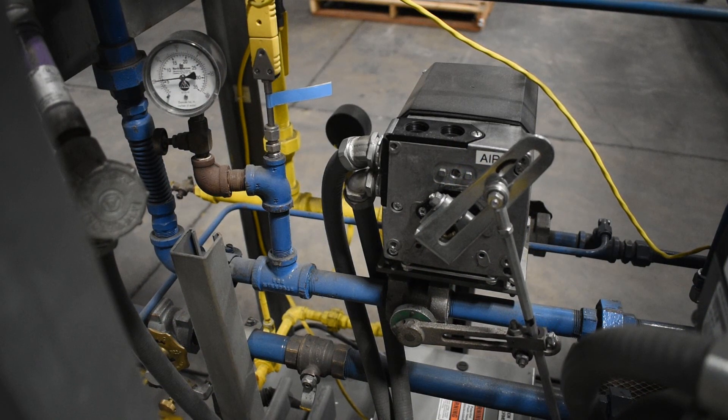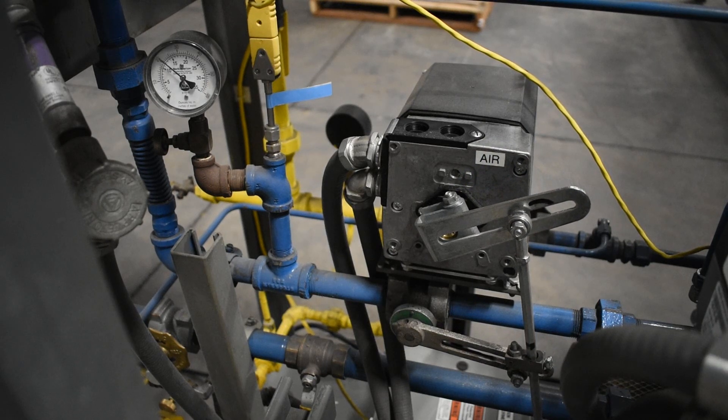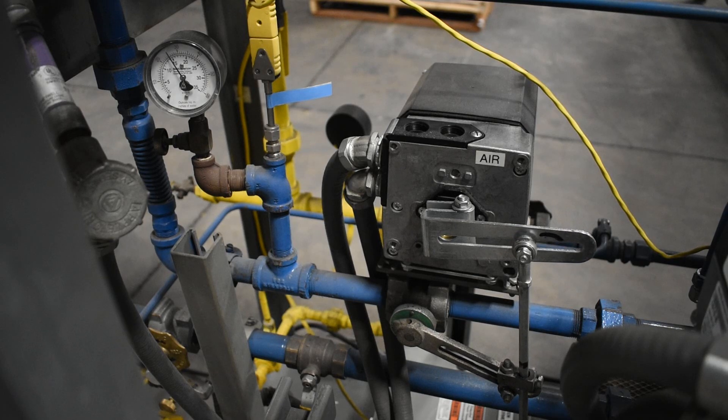Open the valve until the air pressure on the burner is maximized. Although the valve can open further, doing so will have no effect on the system. Avoid over stroking the valve. Butterfly valves have almost 100% flow when 70% open under the best conditions.